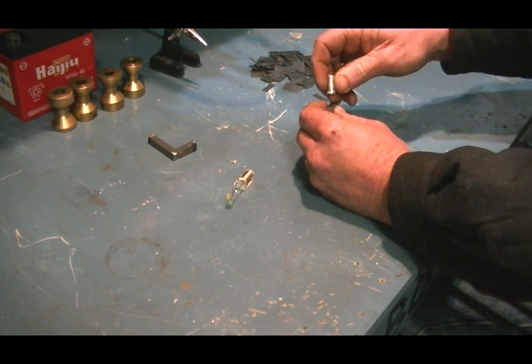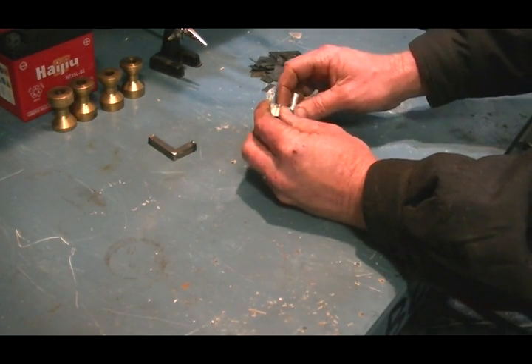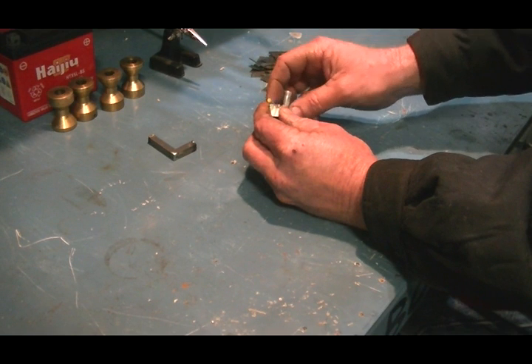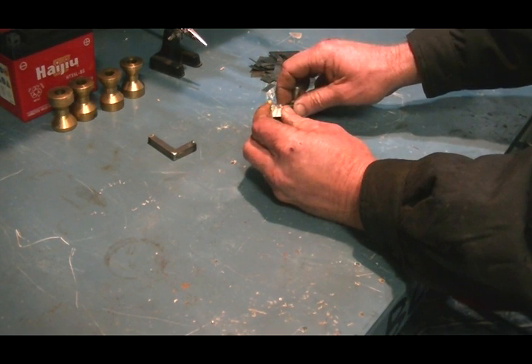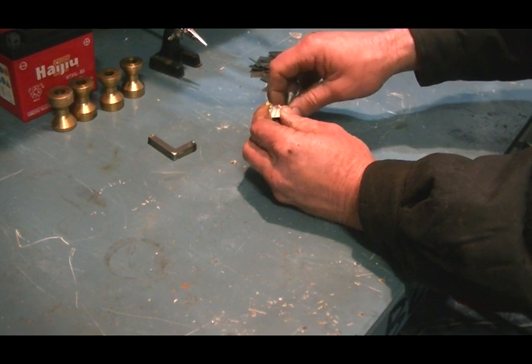So what we're going to do here — I have a magnet and I'll stick the north side down onto the laminated plate. You'll see the yellow light come on when the north field is introduced into the coil, and the green one will come on when the north field is removed from the coil. So that is our alternating current from the same pole of the magnet.